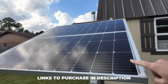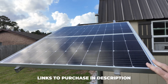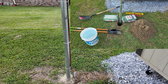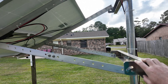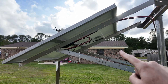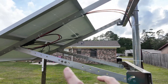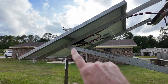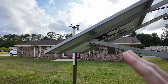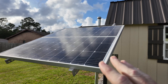These two solar panels are each 100 watts and that is all I need to power my storage shed. These are made by Nupowa and I have them mounted to a steel pole which I put in the ground with some Quickcrete, and the mount is also a Nupowa mount. It will accept up to 400 watts of solar panels, so I could add more or replace these with larger panels. These are plenty enough for what I'm doing here. I'm in sunny Florida so I get plenty of solar. These panels are facing south at about a 26 degree angle, which is good for year-round usage here in Florida.